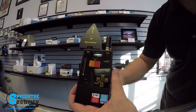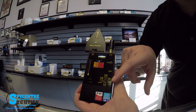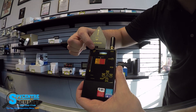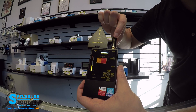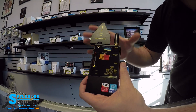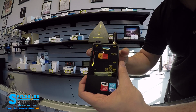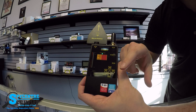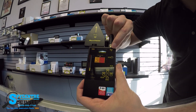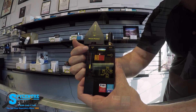Starting on the left-hand side, this is antenna one, and right on the other side is antenna two. This button is literally switching between antenna one and antenna two. They have different purposes and scan different frequency ranges, so do a little research, find out what frequency you're going to be scanning for, and choose the appropriate antenna. All you do to switch them is press the button, and you'll know which antenna you're on by the little orange indicator light.